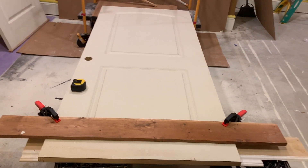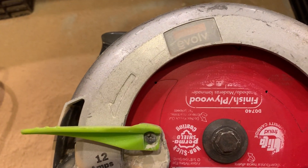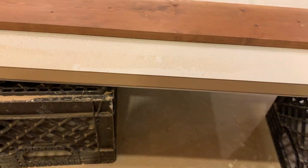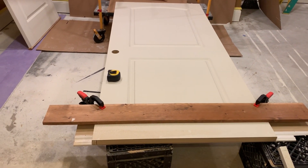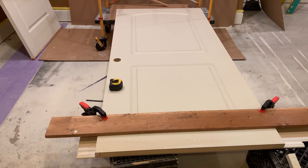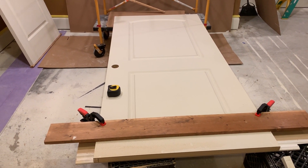So there you go — how to cut a door perfectly straight every time: use a clamp, and make sure you have the right saw blade. This is a 40-tooth plywood finish blade — you don't want to come in with a framing blade or you'll blow your door apart. Also remember: when you paint doors, you should paint all six sides to honor the door manufacturer's warranty. Remind your painter before he gives you a quote, as it may not be included in his price.